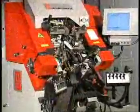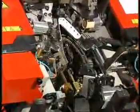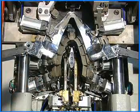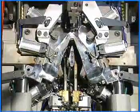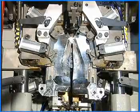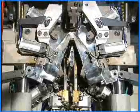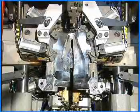Numerical control technology sets the closure of the wipers according to the last being used. To gain a better idea of this significant innovation, here we can see some examples of wiper closures taken from the many available. Here the wipers move forward and close simultaneously at the end of their run. In this example, the wipers close first and then move to the end of their run.